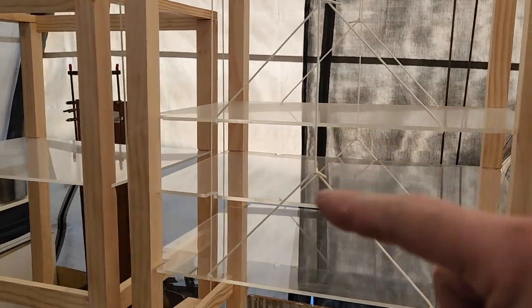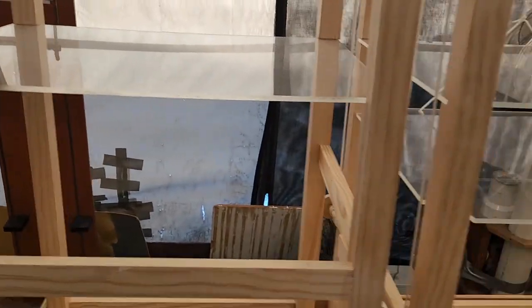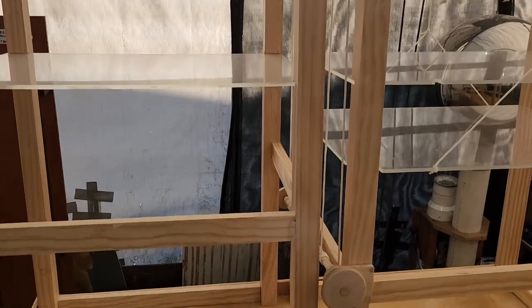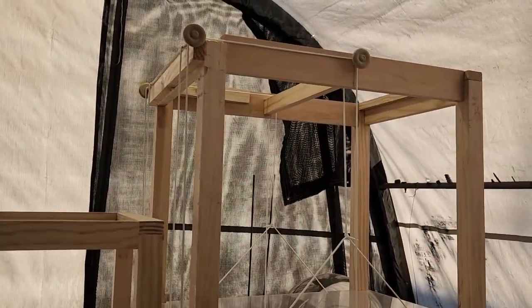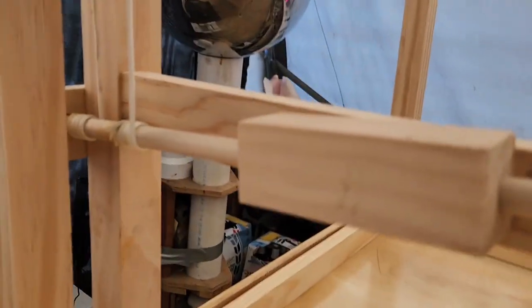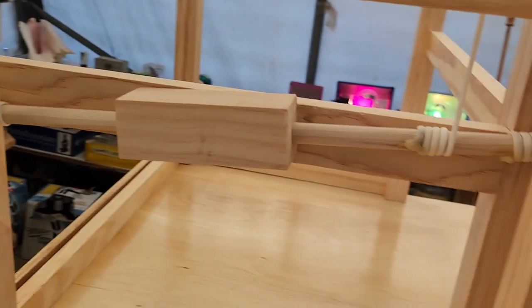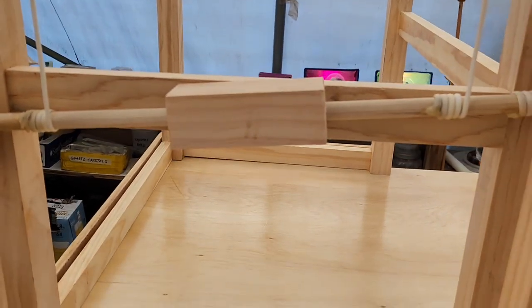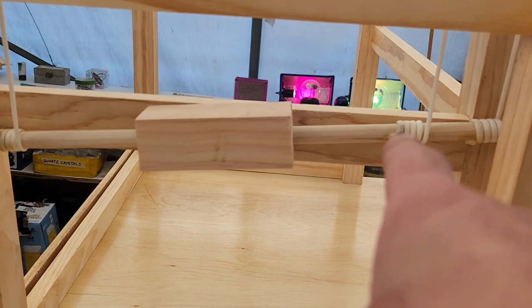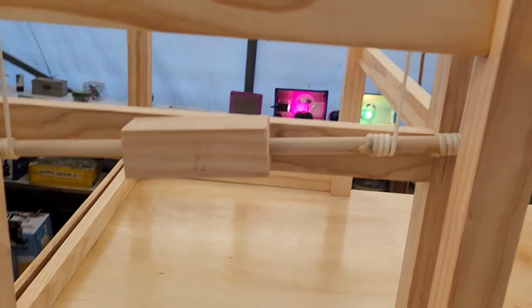I always work with three plates. This middle one is fixed, and the outer ones are fixed but I can actually pull them out too. There's a lot of designing on this - I went through different design concepts until I came up with something fairly simple but that took a lot of thought. There's a crankshaft. There are four strands here, and yes, it's on an angle - that was all part of the design so that when you wind this up it doesn't accidentally wind over itself, which would change your gap distance.